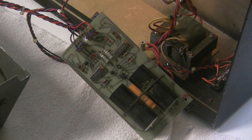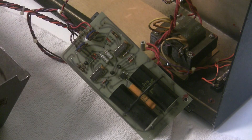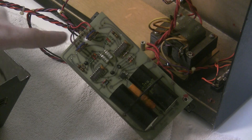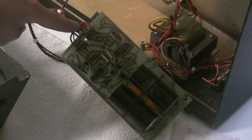Here are the main filter capacitors — they're the same as your other ARP power supplies. The plus 15-volt rail uses a 723 voltage regulator and has a trimmer for adjustment and a pass transistor.